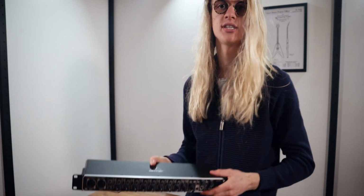So what the pad option allows us to do is, let's say we've plugged something in and the signal strength is super hot and it's clipping our preamp, it's flashing red, it sounds distorted, and it's just not ideal. We can put pad on, we'll click the button in, and then it'll allow us to reduce that signal strength by, I think it's minus 12 dB, something like that, and it's going to make it a little bit more manageable, and then we can set the gain more accordingly.